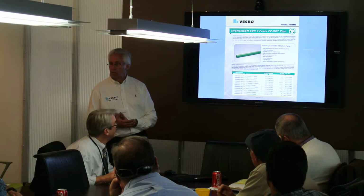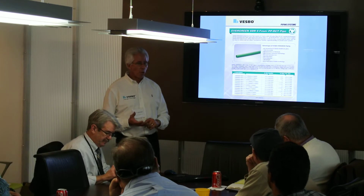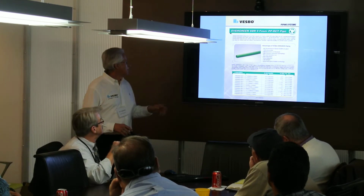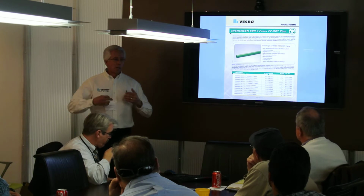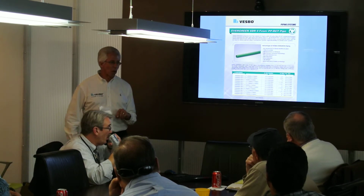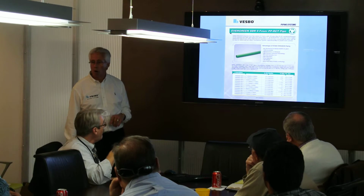The pressure pipe has different SDRs, I just put in a couple of them. We've got 3 piping products. Evergreen, which is the domestic water piping, goes up to 6-inch nominal. Now I will say that polypropylene, like PEX piping and a lot of the piping systems, is truly metric sizes, but we're calling it a nominal size.